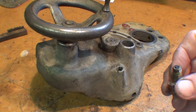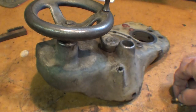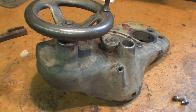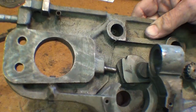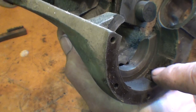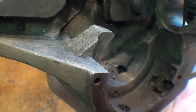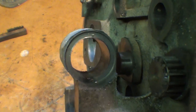Good morning, it's Tubal Cain again and it's a new day. I just took this oiler out of there - notice it is almost totally clogged, as is the passageway itself. First I thought there was a wick in there, it's so hard. So I'm going to clean that up real good. This casting has been cleaned up and I'm almost ready to start reassembling. But notice one other thing here - this of course is that reservoir for oil, and the worm gear is in here. But there's also a wick here - they're like pipe cleaners. And that wick goes up into this other wick in this hole here. That's how that gets oiled.